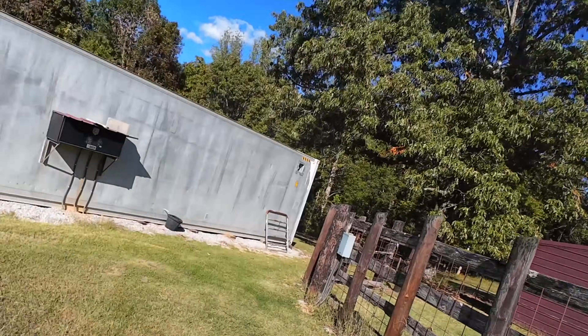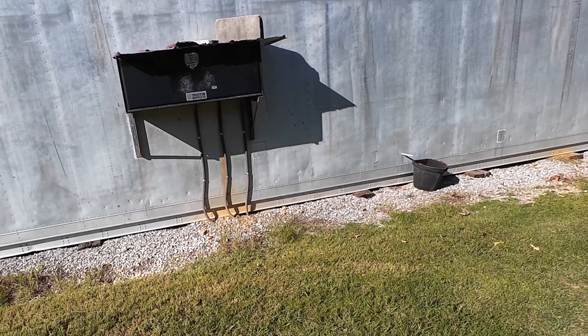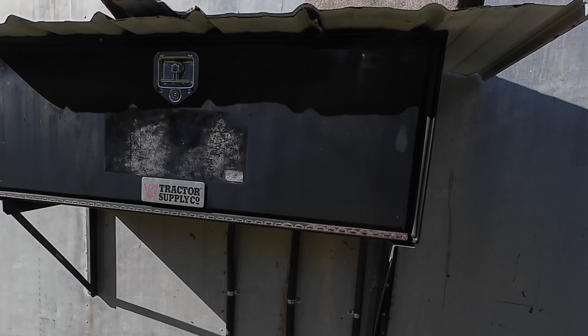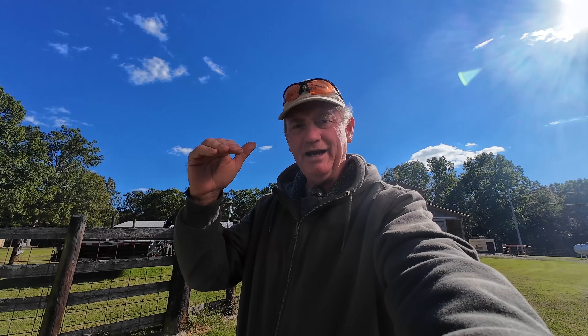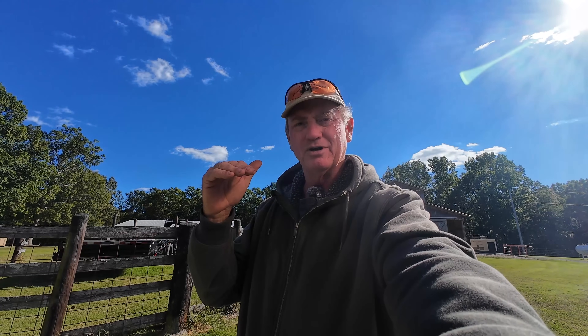And if you have a business operation where you've got to put out a lot of lumber, well, you can't afford to have your kilns tied up. So sometimes in many species, you can manipulate the air drying system through various techniques to get to drying right at the maximum moisture removal rate — so it's drying as fast as the wood can dry out in the air.